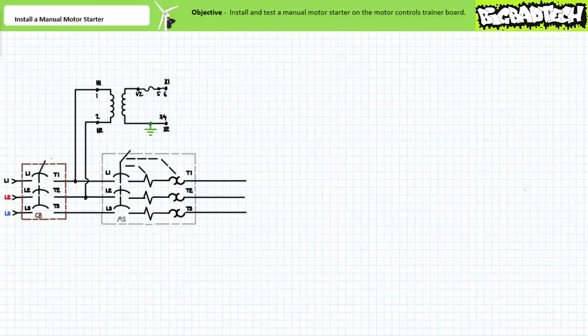If however the circuit breaker is closed and the manual motor starter was open, the control transformer would remain powered and anything connected downstream of the manual motor starter would be depowered. This connection scheme allows a level of functional isolation in that primary devices like motors could be depowered by the manual motor starter. However, the pilot level ladder logic could still function for testing or troubleshooting purposes, or perhaps be used to control other sub-circuits themselves powered and depowered by additional manual motor starters.